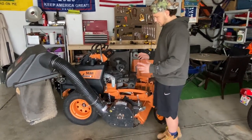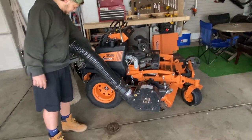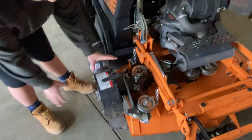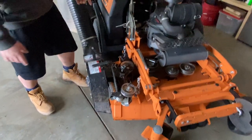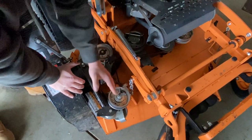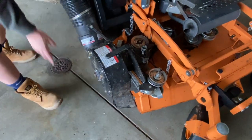So we'll start off with the way it works. There's a mounting bracket that holds it on right here and right here, and this holds on the catcher. You have your tube that runs down here, and here is your vacuum system. It's a powered catcher — it has a belt that runs from your far right pulley and runs through a system of pulleys, and it spins a fan that throws the grass up into the catcher.